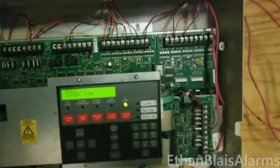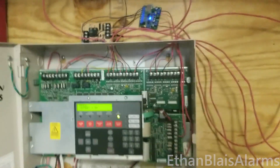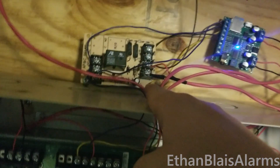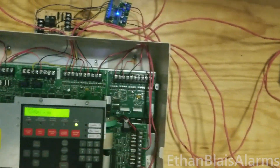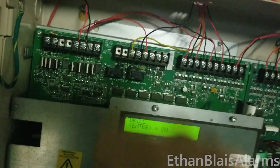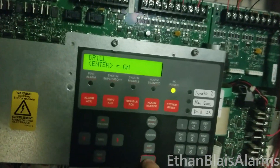The whole staging system here — what I've done is it's just relays, and these relays are tied to alarm group 98, which is the only device on alarm group 98. On my old setup I had the automatic detectors also on 98, but for this test I put them on 97. And 97 flips this relay up here, which activates the verification message. With manual evac it only flips one relay up here, whereas drill flips both relays. This relay right here is the one I need flipped in order to play the evacuation message. So let's hit enter on drill.